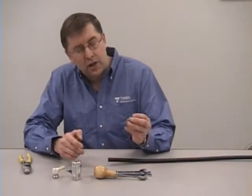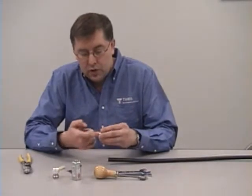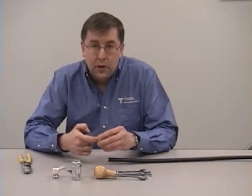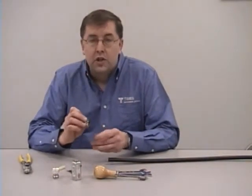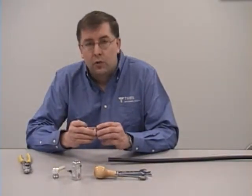In the back section of the connector, there's an O-ring inside that connector. Apply the silicone to that O-ring. It'll do a couple of things. It'll help with lubrication, sliding the back end onto the cable. It'll also help prolong the life of the O-ring.